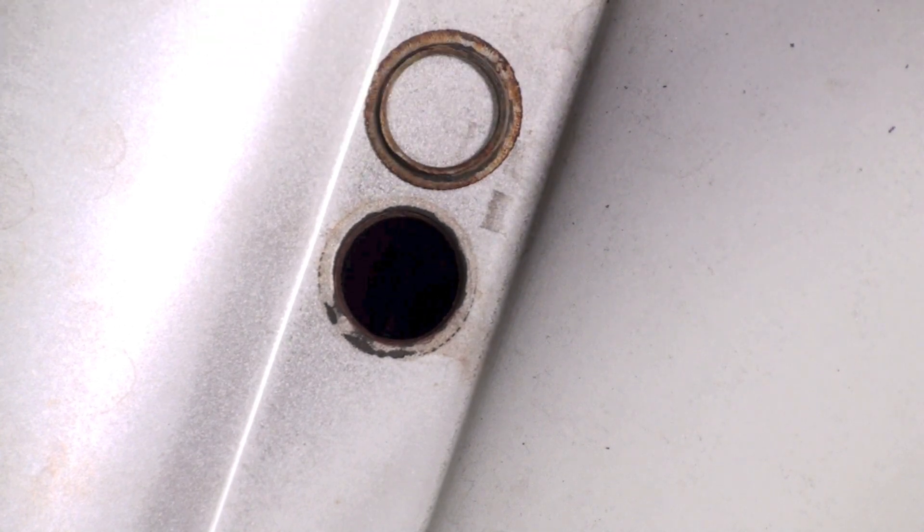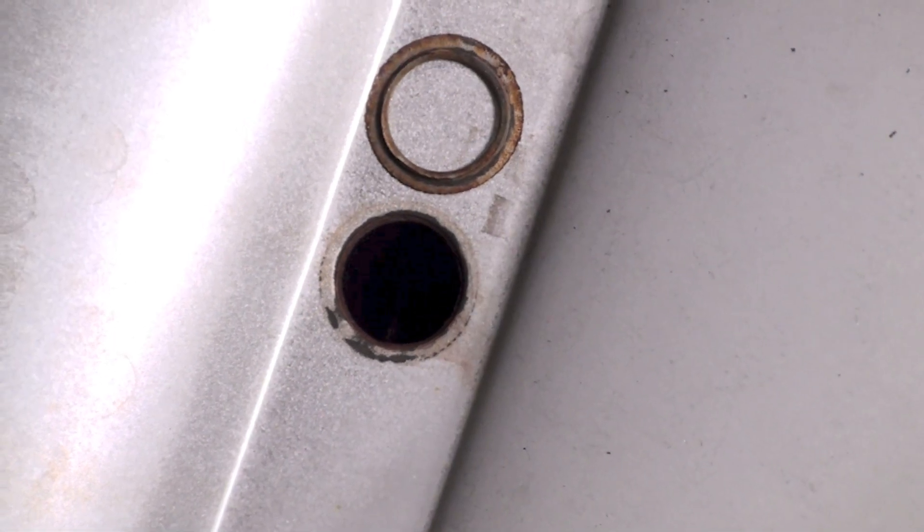Here's the ring — they pop off and drop down. Most of the time they drop into the blower; sometimes they drop onto a blower shelf and you'll find them there. Let's look at the rest of this heat exchanger. There's another one that's popped off — that's a left-hand one that we noticed we were having so much trouble with.